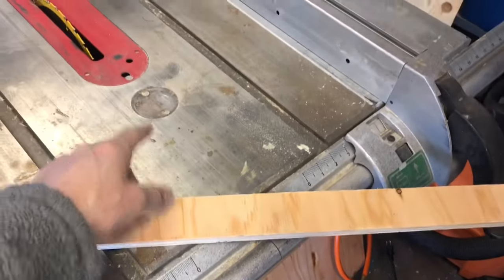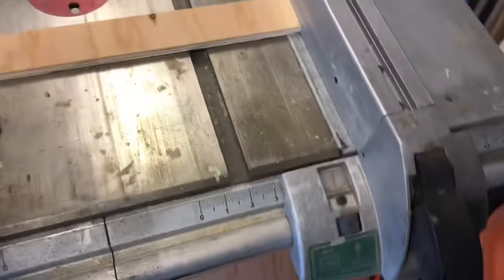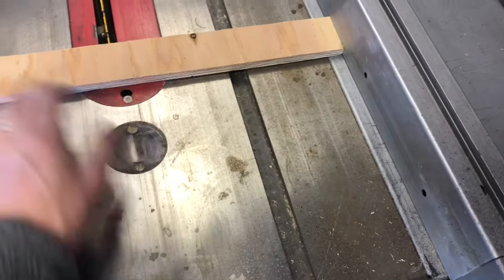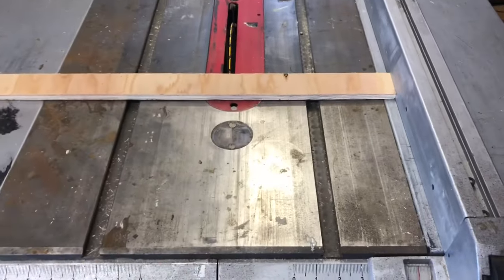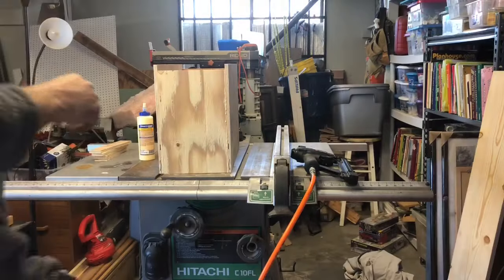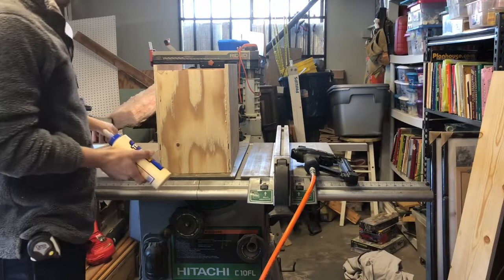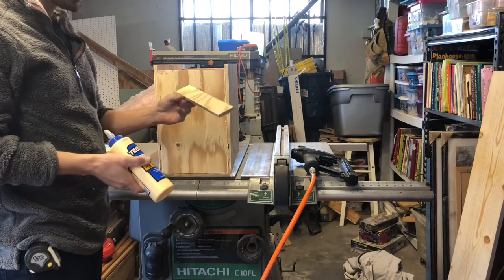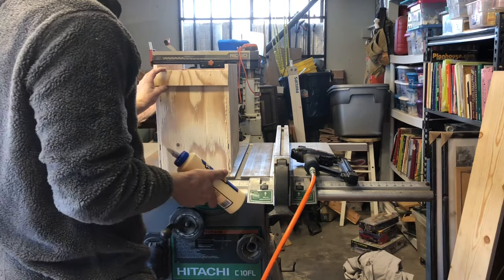And while you still have your cut gauge at 10 inches for the bottom, that's the same width as your box, so you need to cut a cleat. So you're going to cut 2 cleats for your box, okay? 2 10-inch cleats out of the 2-inch strip. Alright guys, so we're going to add our cleats now. So we cut down those 2-inch strips to the same width of the box.